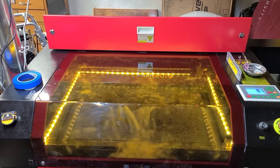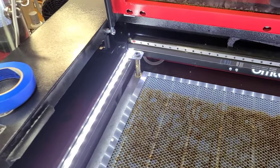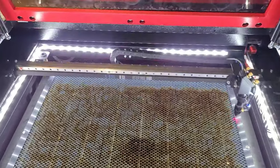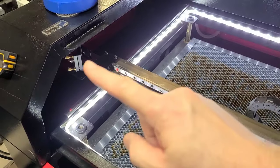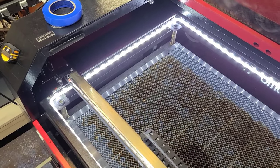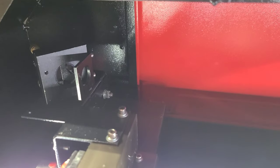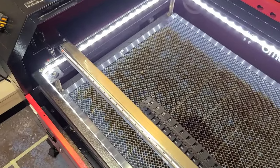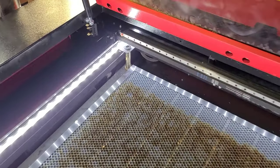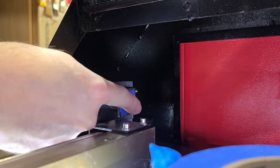We're now back in front of the laser. Go ahead and close your door for the tube, open your lid, and bring your rail down so you can access the second mirror. One thing to note: I moved the rail all the way to the forward position because we're going to put tape on the frame of the second mirror to cover that hole. We're going to fire a pulse, then move the rail all the way to the rear position, fire a pulse once more, and see where those pulses line up. Go ahead and put the tape on the second hole and make an impression with your finger.